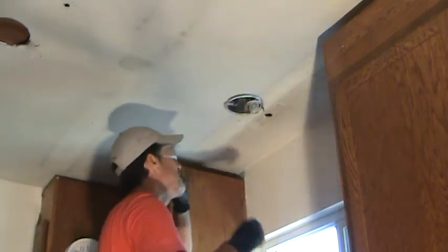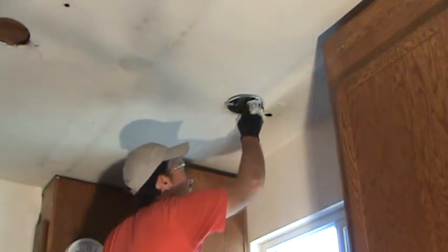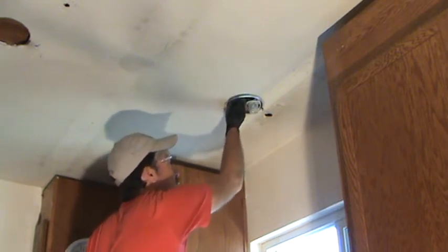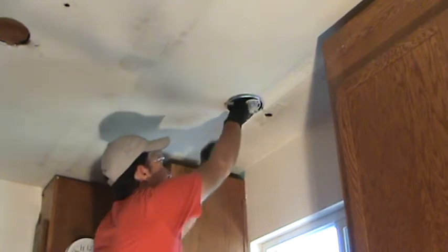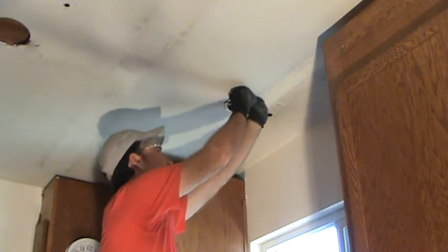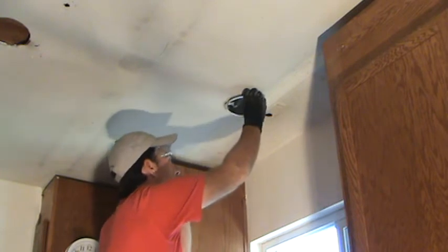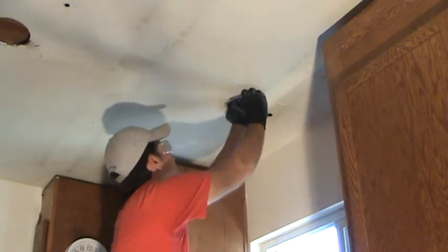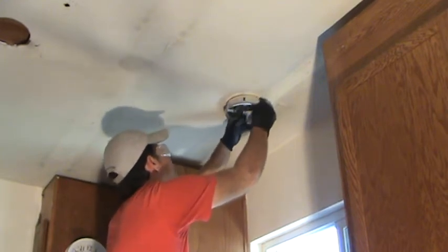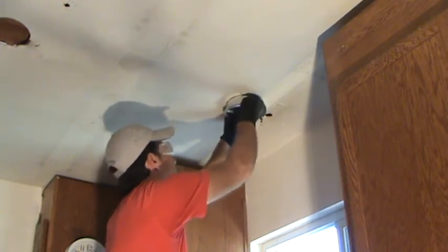Whenever I come across something that's not to my satisfaction, I'll show you. With those tabs, there's a definite little notch and position when you push them in all the way. They weren't snapping. Some ceilings are designed for half-inch sheetrock and some for five-eighths, but either way this one's not snapping all the way. I'm not happy with it, so I'm going to finagle it back down and out of the hole.